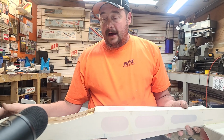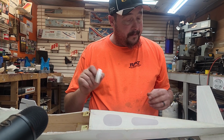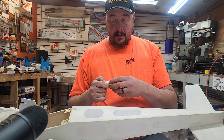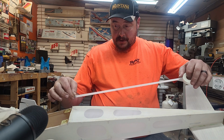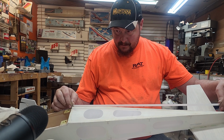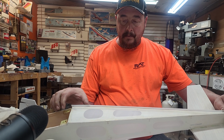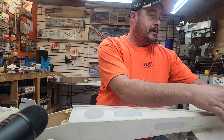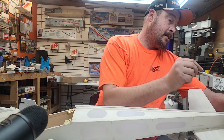Now with these seams on the bottom, I'm going to go ahead and tape those. Okay, and what you do around a 90-degree corner, you split it. Half and half. So we're going to have like a 1/4 inch over 1/4 inch. The way I'll do that, I'll start over here on the side, stretch my tape out, and always overshoot your seams or your ends. Just gently, take your time, and we get it anchored down real good. Cut it loose out here on the end.